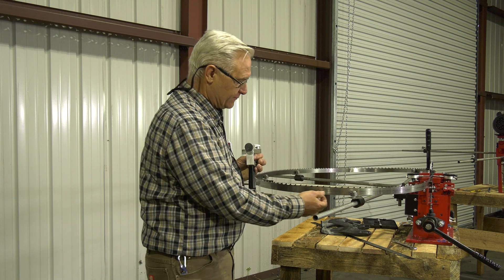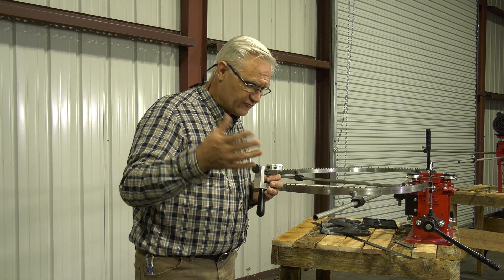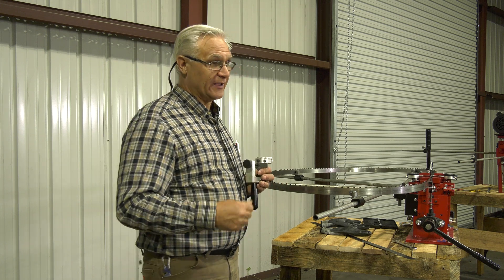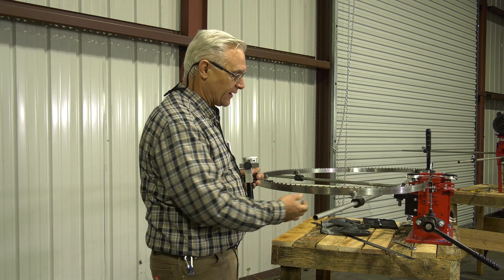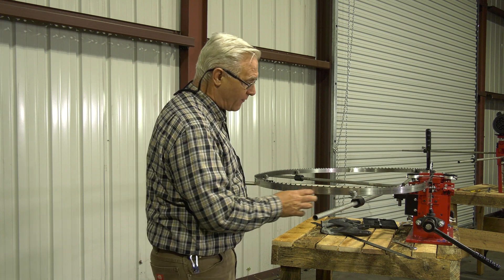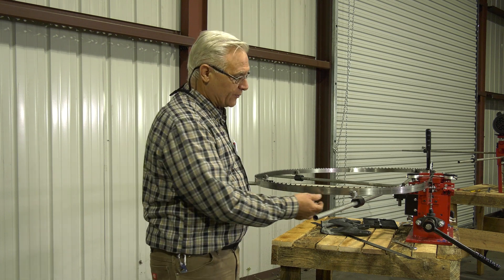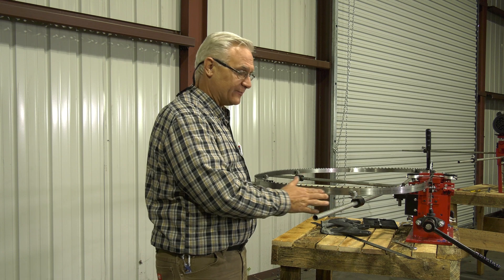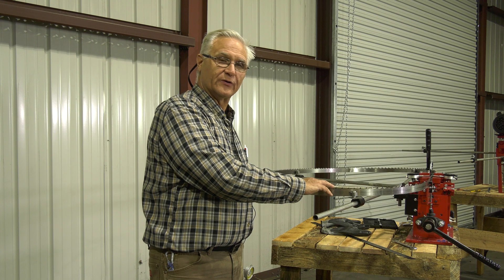To make them run right, you can get buildup on the side from sawdust or sap — even in hardwood, you can get a little sap that'll crust up on there. You're talking maybe five thousandths right there. Once that pine tar or Southern yellow pine builds up on the blade, you won't saw with it anymore. That's why we put a little diesel on it to keep that rubbed off. All that stuff is important because it does affect the set that you're dealing with.